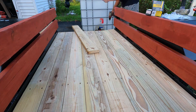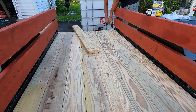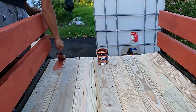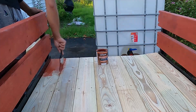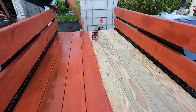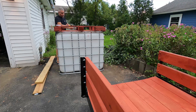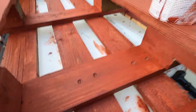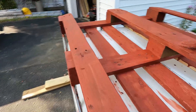The overall fit and finish ended up completely perfect — no need to replace the underlying wood, just a nice freshen-up with new deck boards. Once the new deck was installed and screwed down, the obvious next step was to apply more Valspar deck stain in the same color across the entire new deck surface. I gave all wood surfaces two coats for maximum protection. I also flipped over the tote and deburred the bottom wood structure where the plastic and metal connects, then gave it two coats of the same stain.